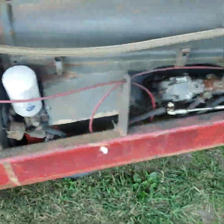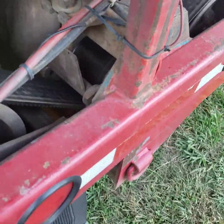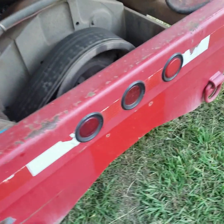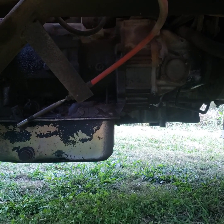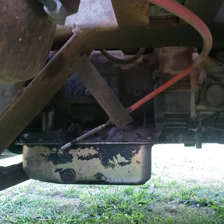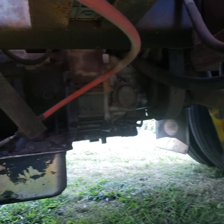Down in here you can see the air conditioner compressor, belt driven in there — key to a happy or grumpy sled operator. And back here on the business end of things, this is a 5V, 5-groove drive belt; there's the belt tensioner there, pushes down on the idler pulley. And there's our bell housing of the transmission. This is an Allison MT653 automatic transmission. Now this particular model has a planetary gear reduction drive in low gear; it is hooked to a shift cable there — you can pull it down in low gear if you're on a heavy load on a soft track or something, it likes to grunt and growl a little bit to get going.